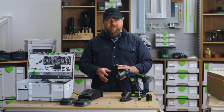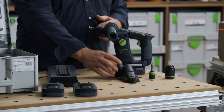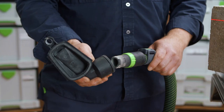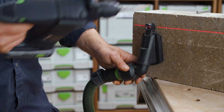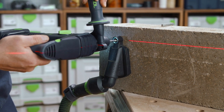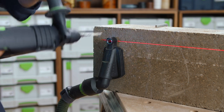One of my favorite accessories is the drilling dust nozzle, the D27BSD. You can attach it to the Festool 27mm extraction hose, place it where you need to drill a hole, and as soon as you start the BHC, the extractor will start and the nozzle will suck itself to the substrate, freeing up your hands to focus on the application.